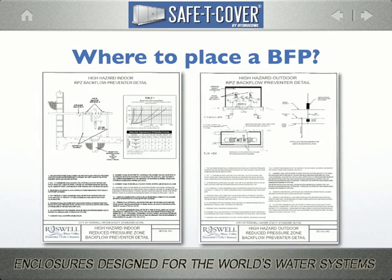Allow me to offer Exhibit A in this more enlightened approach. Roswell, Georgia is an Atlanta suburb of 200,000 people in Fulton County. Because legacy methods die slowly, they've articulated a very sensible middle ground position for getting more backflow preventers out of harm's way. They've detailed 2 methods of RPZ placement, one indoors and one outdoors, explicitly addressing the drain pipe requirements for all equipment with those previous shown tables.